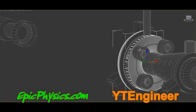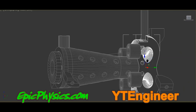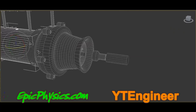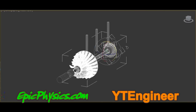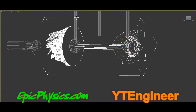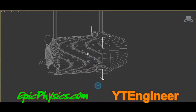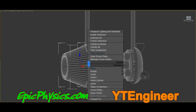I have done some basic tests on both the starting motor assembly and the combustion chamber, although both need minor modifications. In many of the videos that I have seen online that claim to show a micro jet engine, the starting motor is connected directly to the engine and cannot be disengaged. For this reason the engine can never start, as the drag of the electric motor will not allow the engine to spool up.